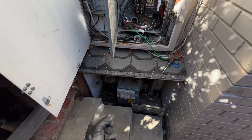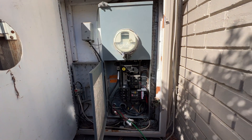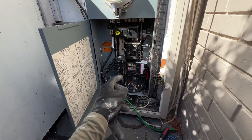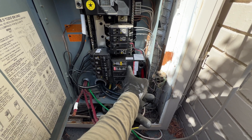Right here is the main panel. We cannot install Tesla because we have this gas meter right under the panel, so the Tesla backup switch cannot be installed here. So we're going to install Solark, and for full home backup we'll need to move these loads. We have a lug kit installed by another contractor which is going to the sub-panel.